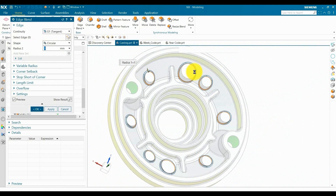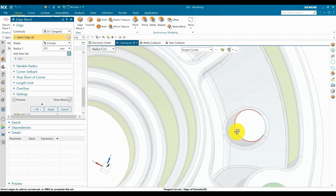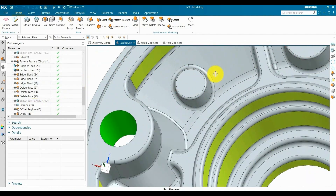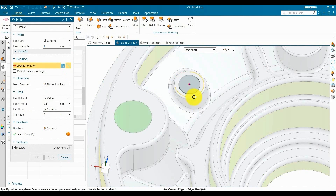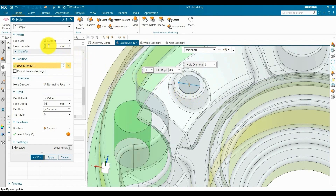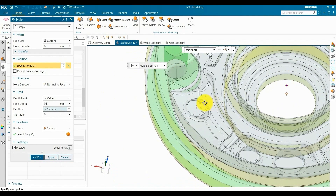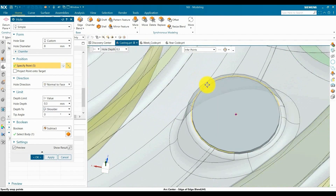On top, we are going to provide 0.5 radius because we took the diameter 1mm more, so 0.5 radius. Then the size of the ejector pin and the year code or shift code will be exactly the same after the flat area. Now we are going to use the hole command to show the ejector pin mark, which is in depth because this is an as-cast area. So we are going to use a flat ejector pin in this case — we keep the depth 0.3 for the diameter 8 ejector pin. We can also use a profile ejector pin, but that may make die maintenance harder.